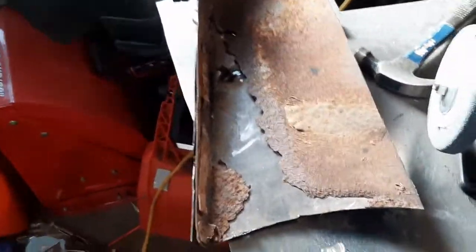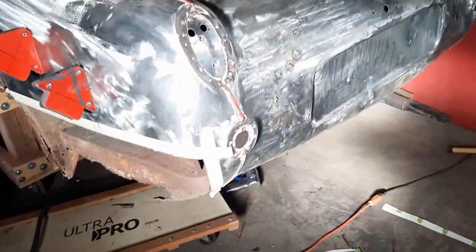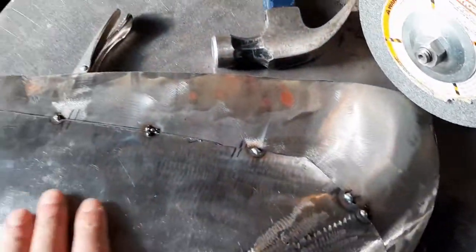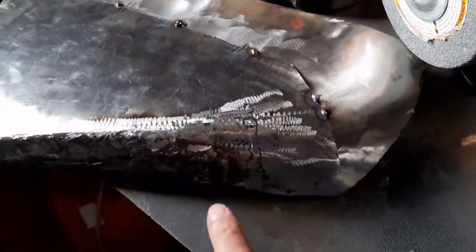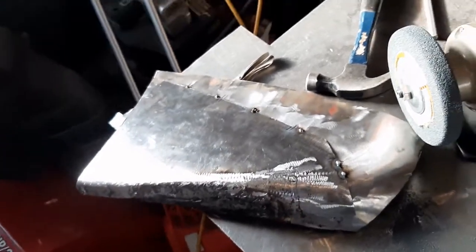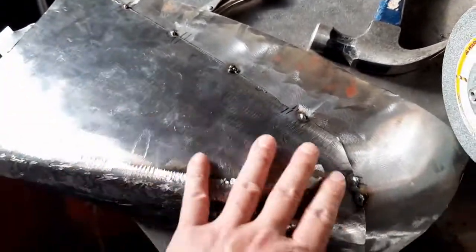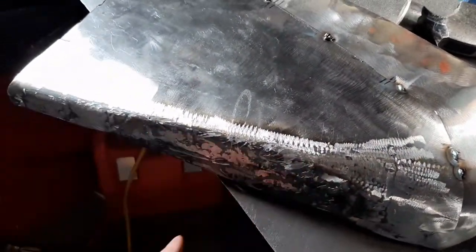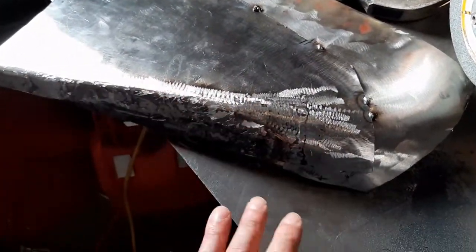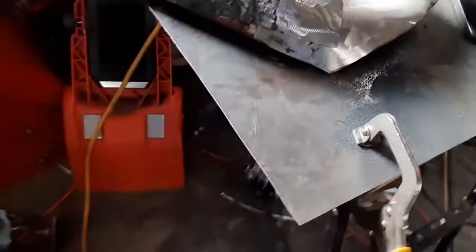So this is the back of, you can see the old rusted fender here. This is off the other side. And I made this on the English wheel, and obviously did a little welding too. So what I did is I English wheeled all of this and thought I turned record on, but didn't. So anyway, I rolled this and then I sliced it a few times up here, bent it in, put it over top of the old fender, banged it into place, ground the welds. That's a really rough grind. I'm not happy with the grind, but...